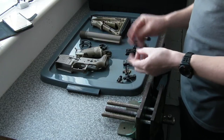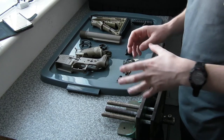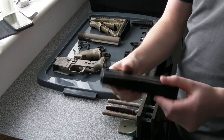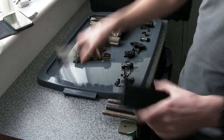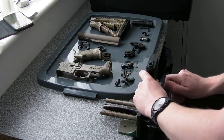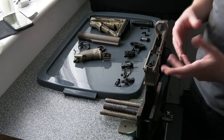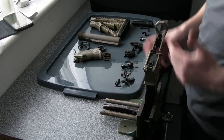Starting off, we're going to work through this — pretty much goes in the smallest bits along here, up to the largest stuff. To actually mount the receiver while I work on it — it's a magazine I've modified, just a cheap plastic mid-cap. I did a video about this before: I just filed a couple of surfaces here which means it will fit into the lower of the LM4. I'll just use it as a tool now so that sits in the vise. Clamp that, lower sits on — you've got a really good platform for actually doing your work when you're trying to put pins in and out. The lower isn't just sliding around the table — it's set there and you can get the work done.